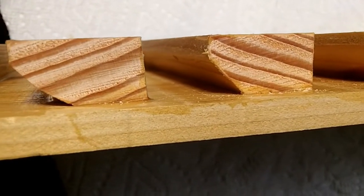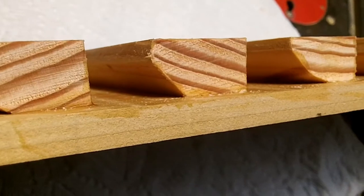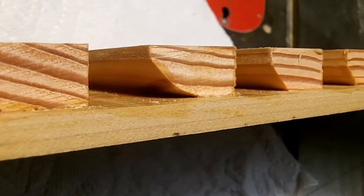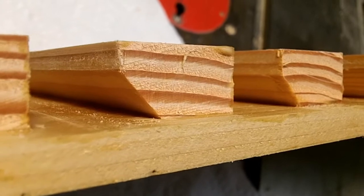Well, for some of you who have access to a table saw, you may want to cut this little 45-degree angle on some of your riffles. This will give the gold a place to scoot back up under and get out of the water currents a little bit better.